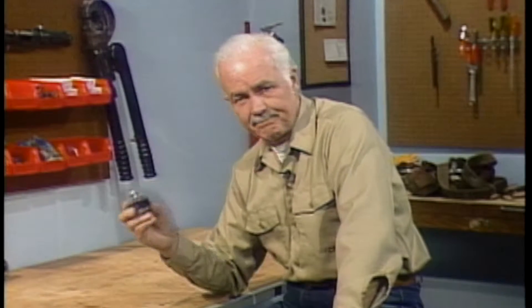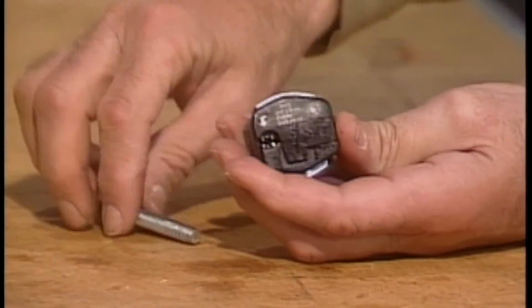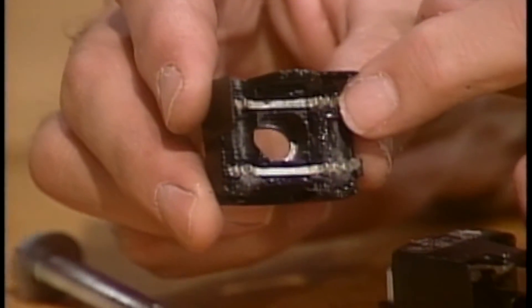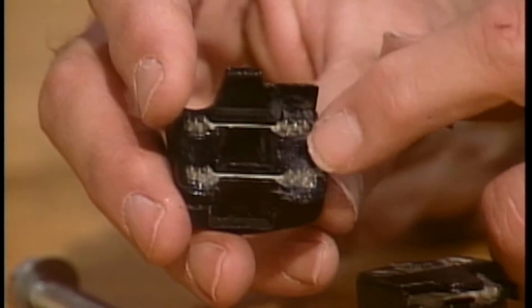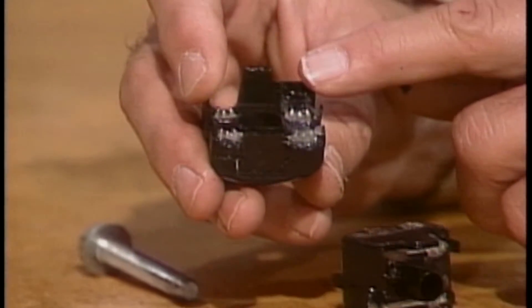This mechanical connector is a variation of the single-bolt parallel groove connector. It has a single-threaded bolt, but instead of two plain plates, this connector has two halves that mesh together. Inside each half are toothed contacts. Each wire that is to be connected is placed in one groove and pushed through the connector until it touches the connector end tab. The tab can be easily knocked out if, for example, one of the wires is continuous, such as a secondary main.